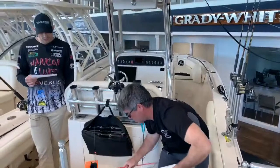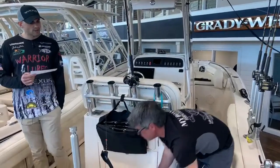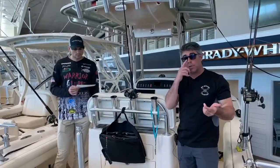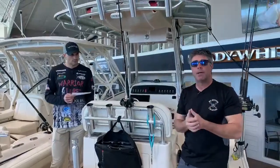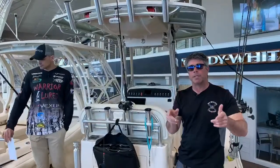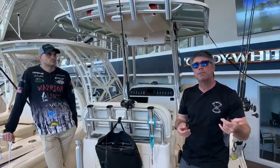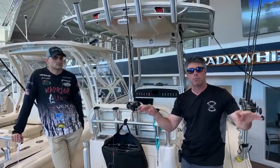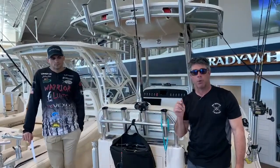The next question kind of goes along with that: when your big board is jumping in bigger waves, how do you prevent that? We run the snubber, but I'll be honest with you, at some point, you have to make a decision. Typically when I set my boat up in the morning, I'm going with the waves. So boards jumping the waves really doesn't become a huge issue for me. Now, eventually I need to turn back around and run into the waves. If the waves are so big that I'm having a hard time keeping my boards running right, I'll pull gear and I'll run back upwind and come back down with the waves at my stern.